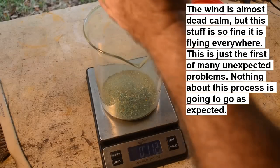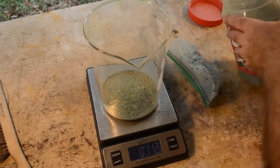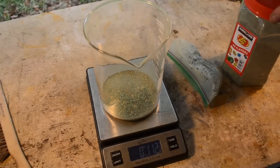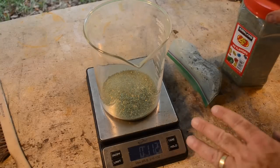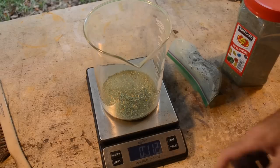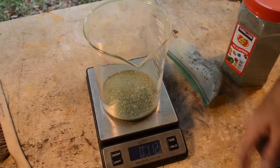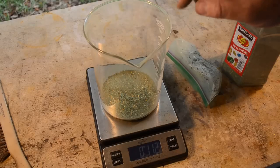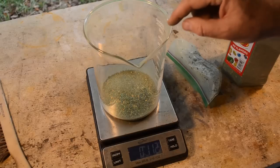There's a hundred and twelve grams of material in that beaker. I'm going to do a small scale test on the hundred and twelve grams. I'll brush what I can see on the bench off into the beaker too because there are some gold foils laying around now. Then I'll put this in my fume hood and hit it with some aqua regia and see what happens.